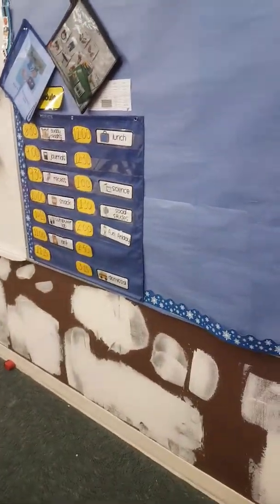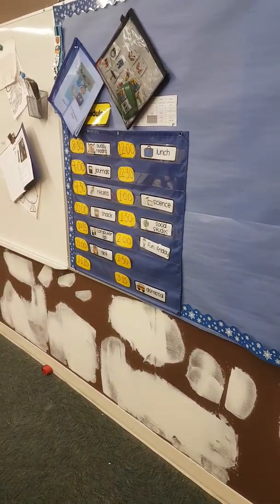This particular bottom section was really badly beaten up — we've got squiggle lines, chunks missing, dents. It was in pretty bad shape. I was going to skip coat the whole wall, but I didn't want to go through the whole wall because, as you can see, there are some smooth areas. So we're going to sand that down, prime that whole area to seal the drywall mud, and then put two coats of the brown on.